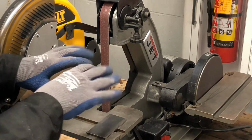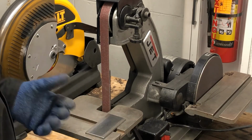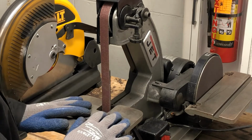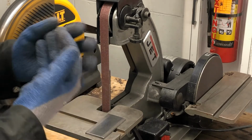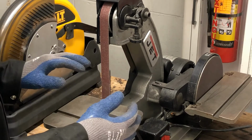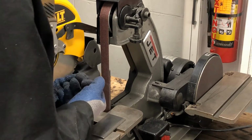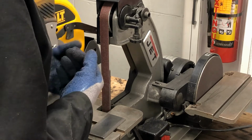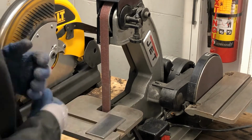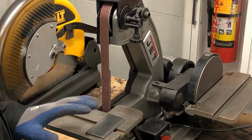A lot of times people say don't use gloves around machinery. Well, it depends on the gloves, depends on the machines. Okay, these gloves are okay, in my opinion, to use around the machines because they're tight fitting to your hands. What you don't want around the machinery is loose articles. A loose flappy glove, strings dangling from a hoodie, hair, earrings, necklaces, headphone strings, anything that's dangling, you should not have dangling on you. It should be off. You should be ready to work and safe.